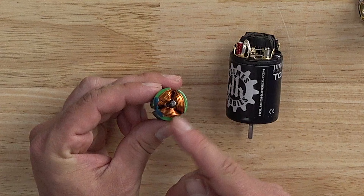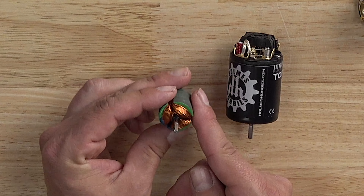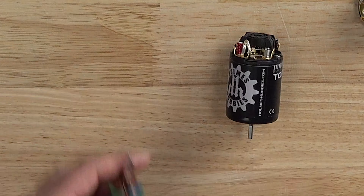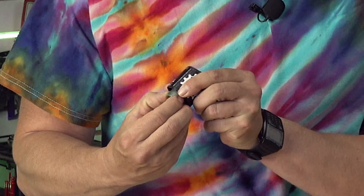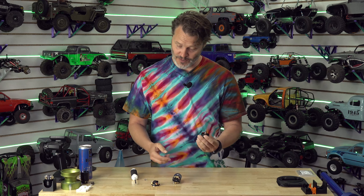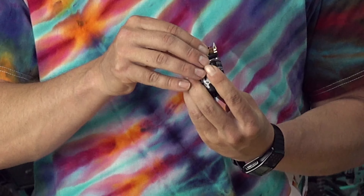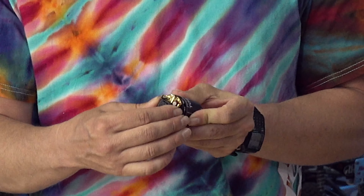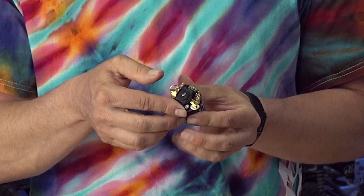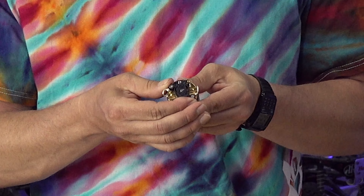You will essentially burn the motor up before anything goes wrong on these. But as you can see, the windings are all perfectly even. With a three-slot you get these perfect pyramids, and that allows us to pack in the most amount of copper. You get the most torque, the most efficiency that you possibly can. In general, these are really high-quality motors and we love producing them. We've been making these in-house for quite a while.